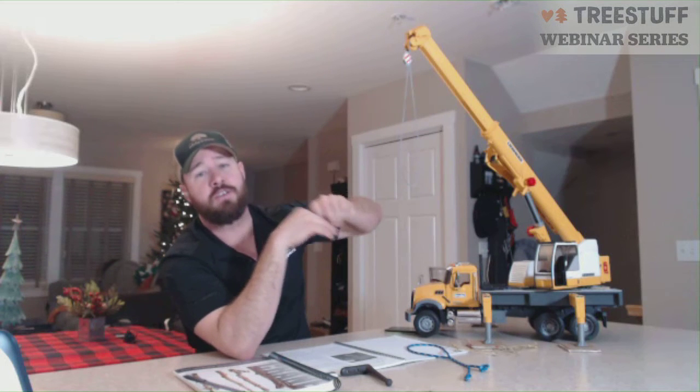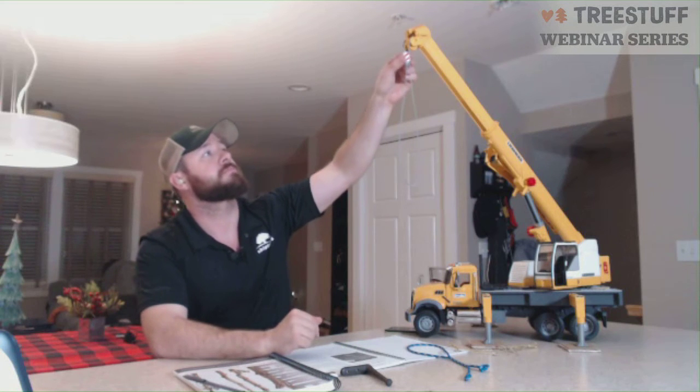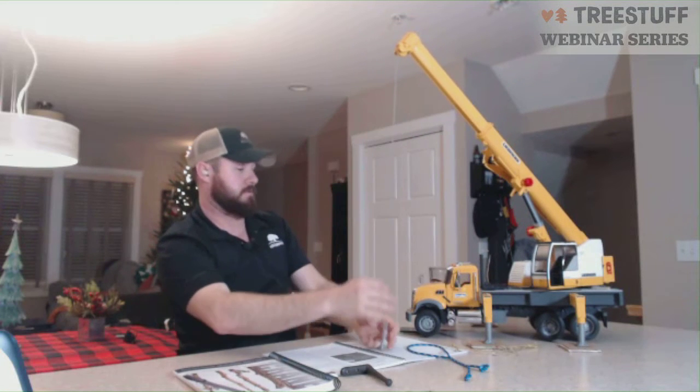An overhaul ball is used for only one part of line. A block is used for multiple parts of line. Some cranes go all the way up to 10 parts of line on a block. So you have the ability to have lots of different capacities, lots of different configurations there. Does that answer your question? Yeah, whoever had that question? No, yeah, that's a great explanation of it, I think.